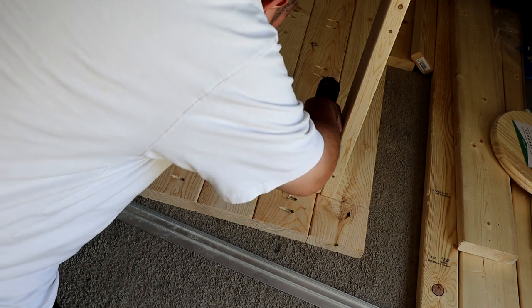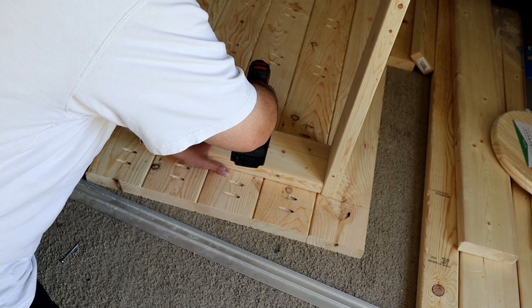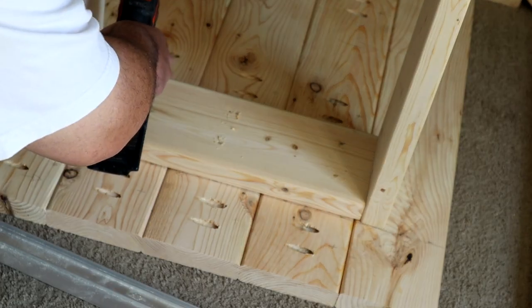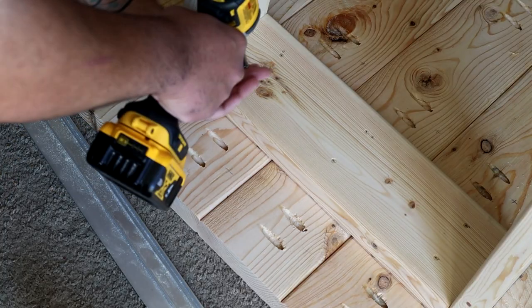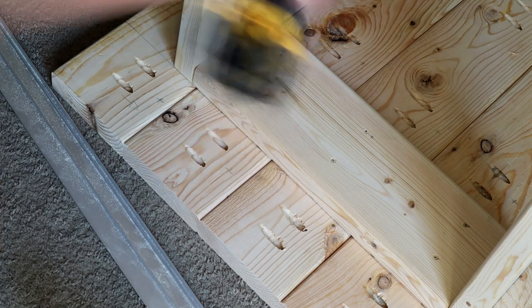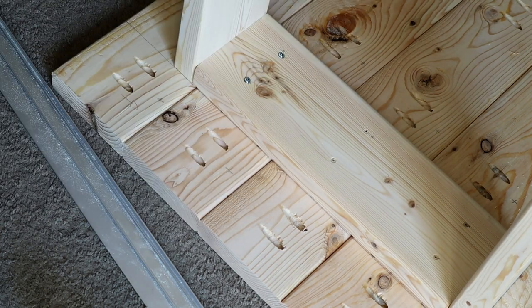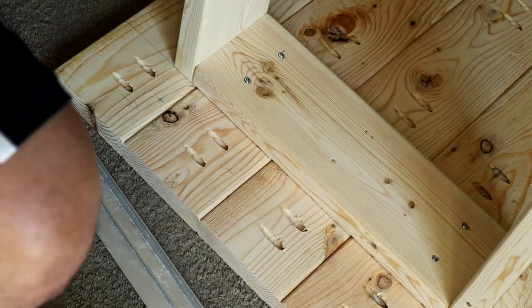Put some pilot holes in first — it's always best to put pilot holes in first so everything matches up right and goes in nice and smooth. I'm ready to drill these in. I didn't add any glue at the bottom because it's a big desk, so if I need to move it and it won't fit through a door or something, I can always detach these legs.